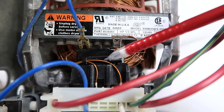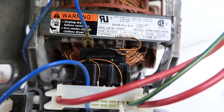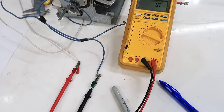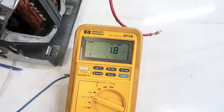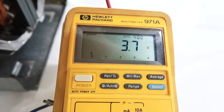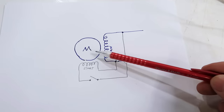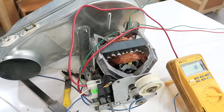On this motor we can see there's a thicker wire and a thinner wire coming to this block here, and here they're connected together. Connecting my ohmmeter between the white and the blue wires, it shows 1.8 ohms — that's DC resistance, not AC resistance. If the motor gets up to speed, the starter winding should get disconnected. Let's push this in here and pretend it's running — now we have 3.7 ohms. Let go of that, back to 1.8 ohms. So that tells me when the motor is running, a switch disengages one of the windings. I'm pretty sure I've got this right now.